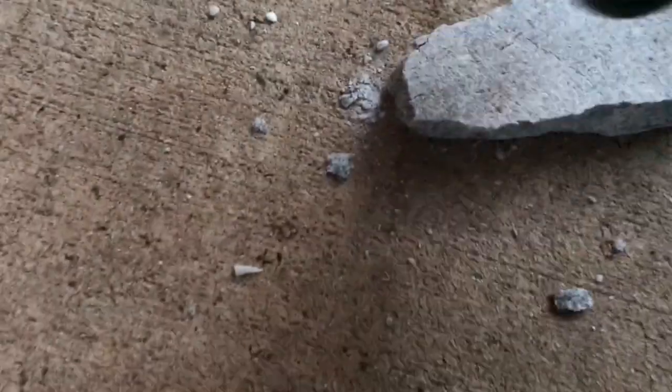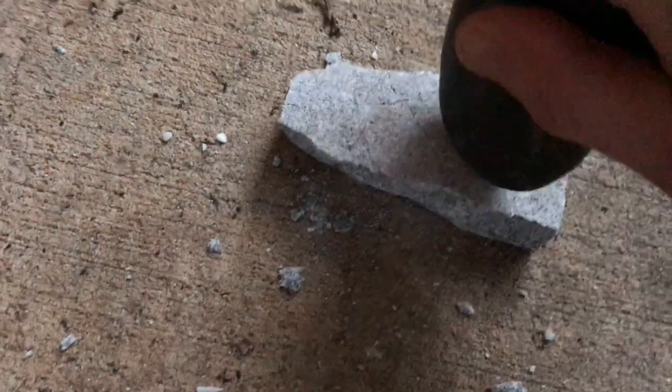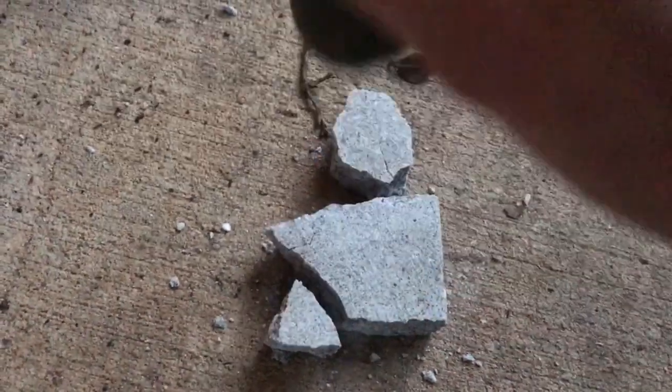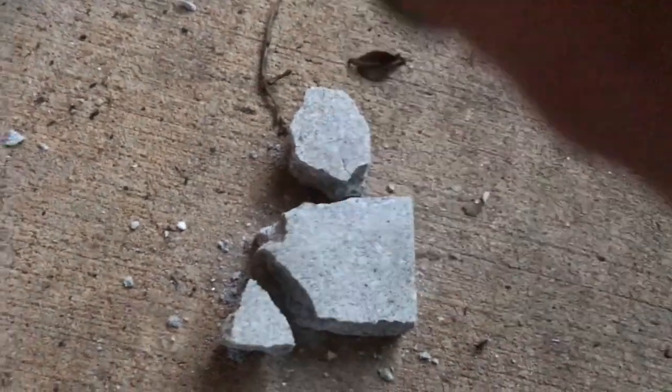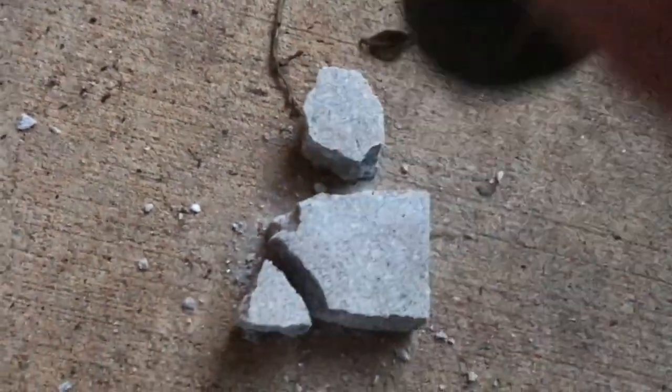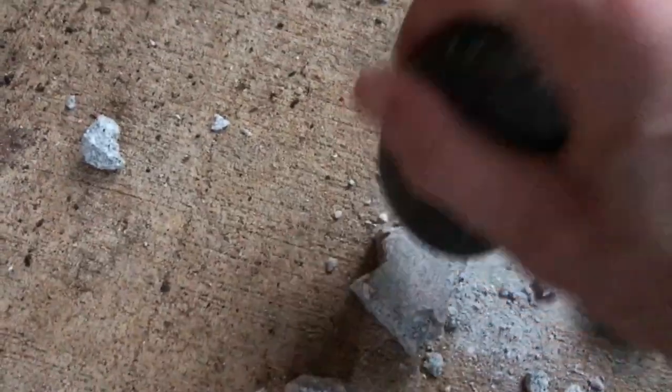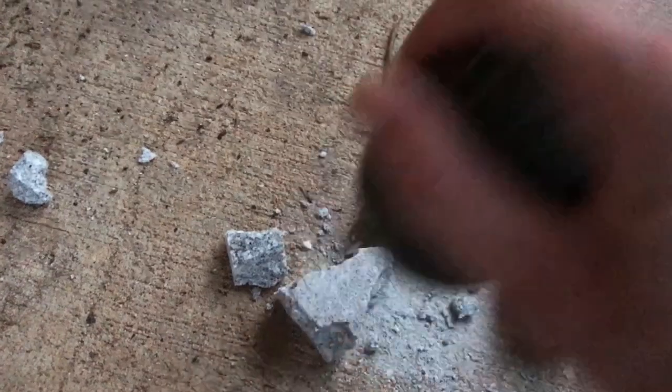Here's a piece of gray granite that I fire-set as well, and so it's not just about breaking up the stone and quarrying — there's an added benefit. Using a stone pounder with one hand, if I had done this without treating the granite I would have eventually broken it up, but what happens is you start breaking up that granite — there are all these little micro-cracks — and it starts not only breaking apart but crumbling into a fine powder, a fine dust, fine little grit.